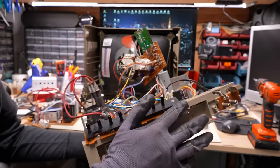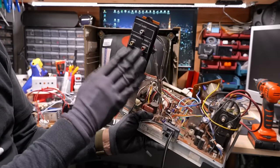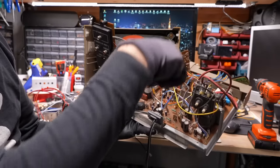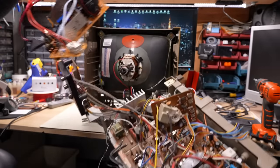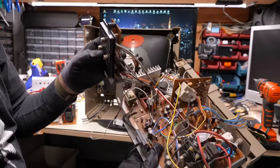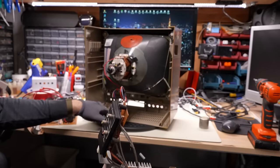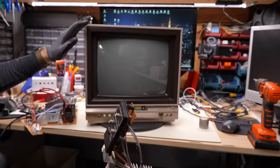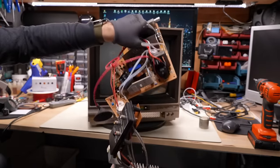Even better is that the original circuit board is all self-contained on this metal chassis, which includes what protrudes through the front: the controls for adjustments, the front video inputs, the power switch, the power light, and on this rear board, the rear video inputs. It's all self-contained, which means all you need to do is gut it of its original electronics, mount the new board, get everything connected to the video inputs and power switch, slide it into the case, and reassemble — and you'd be almost none the wiser that inside was now a multi-standard, modern video processing board with tuner.